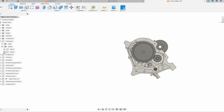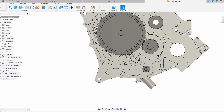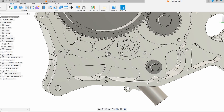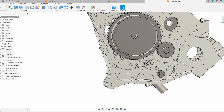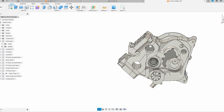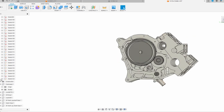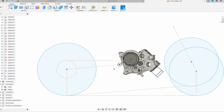My problem with this layout is look at the size of it, look at the length of it. In this unconventional split — what you'll also see, and I'm quite proud of this — there is a chain off the back of the clutch and I'll have that driving a sprocket here. I just need to make some more room, probably move this case out, and put a sprocket here that will drive the water pump.